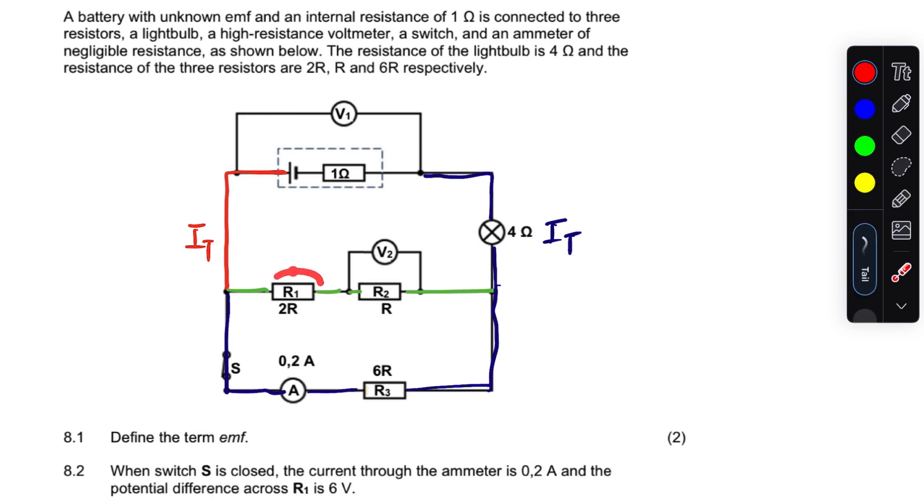So now we can conclude that this circuit is a combination. If you look at the two resistors R1 and R2, they are in series in a parallel line. The combination of these two resistors is parallel to R3. The voltmeter in the parallel section means the voltage here and the voltage here are equal. The ammeter reads this parallel section — it reads 0.2 amps, so the current that passes here out of the total is 0.2 amps.